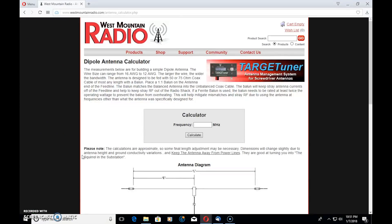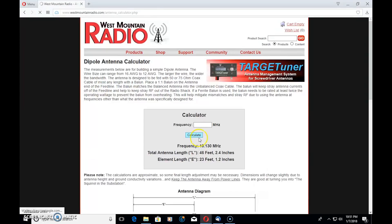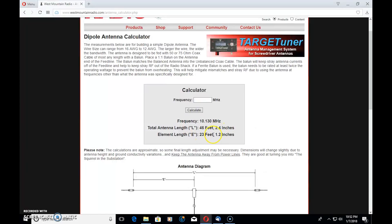Now that we're going lower in frequency, if your antenna doesn't do 30 meters and you wanted to throw up a simple dipole — which is all you would need on 30 meters — how long would it be? We're going lower in frequency, so the antennas are getting longer. 10.130 would be about the center of the band there, and you can see 46 feet two inches roughly for a half-wave dipole — almost 50 feet. Can you handle a 50-foot dipole on your property? Something to consider. My AV680 does 30 meters, but I've had antennas that weren't native to 30 meters. Even some wire antenna designs I made, I had to use a tuner and it was a 10-to-1 SWR before I tuned up, so it really wasn't efficient. Call it almost 50 feet by the time you cut it long and trim off the ends until you get it tuned just where you want it in the band.